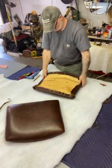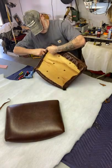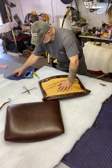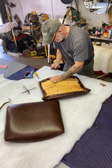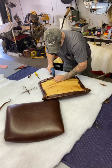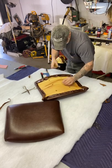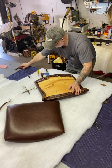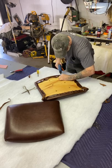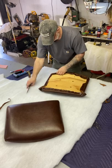So that's what we do. Boom. And that's our front. And then you come through. After you make sure, well, there's a little wrinkle there we can get rid of. There's no reason to ever have a wrinkle, ever. Pull it tight, go in the middle, split the difference, and then come down and staple your way all the way down the front of your piece. There's a wrinkle, get rid of that. Pull it tight, come in the middle, split the difference. Boom, boom. And that's good.